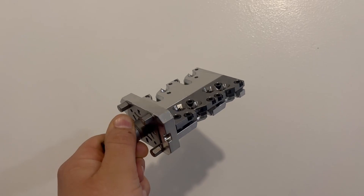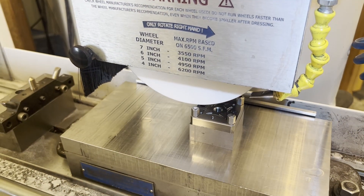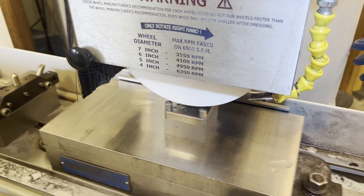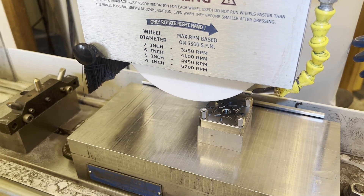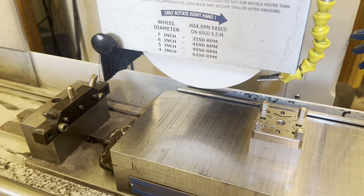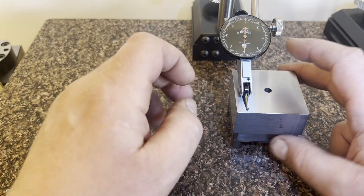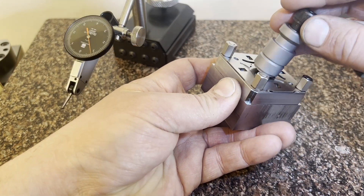This is one of the mini tombstones I make a lot — I'll just put that bolt pattern on the back of a chunk of aluminum and stick it in the fourth. Back on the grinder, we'll just dust a few tenths off until all four feet are co-planar; it usually doesn't take much. We're also trying to maintain a height from the base to the top of the feet that Erowa suggests, and it usually comes right in with no issues. Then we'll check for parallelism and do a little wiggle check to make sure it's not rocking on its feet — it's sitting pretty stable, so all we need is to put the pull stud in and it can go right into one of our Erowa chucks.